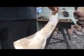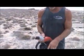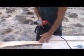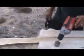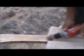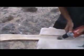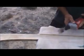So you just continue on and dig it out to here, and you're pretty much set to take care of the inside. But I prefer this kind of a thing over a big giant set of teeth on a saw. The other thing I use is this sander on the end of this drill. What that allows is, after you've done cutting the inside, you can sand all this rough stuff down real easy. As you can see, it makes the sanding real easy instead of doing it by hand.